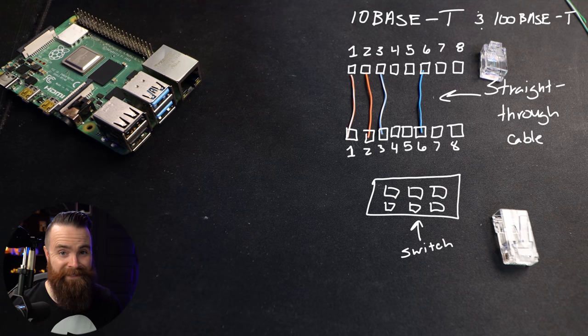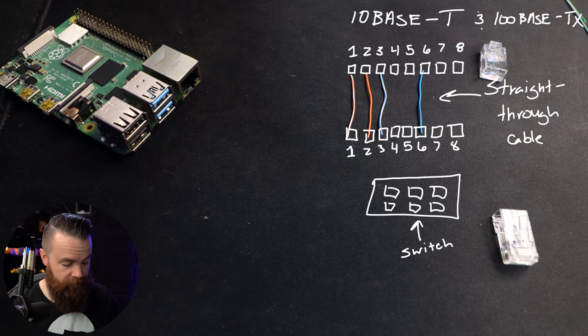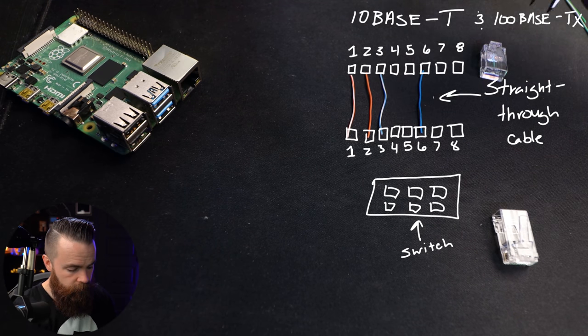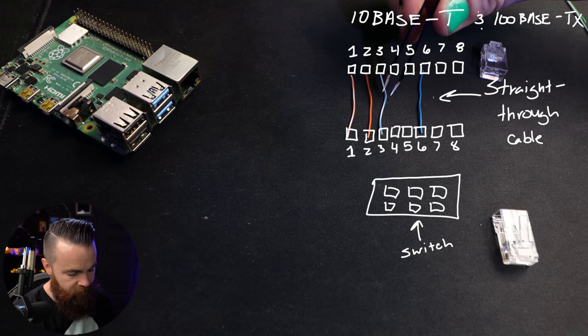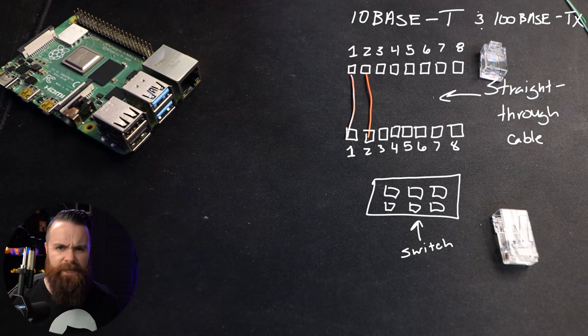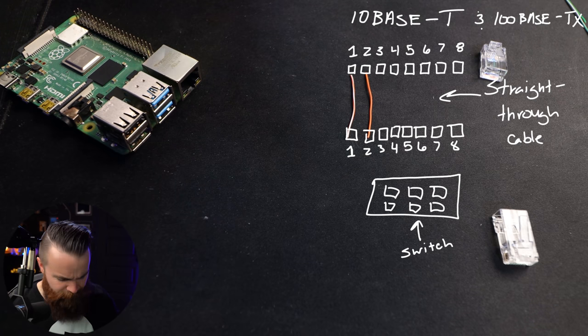The way we've arranged our copper wires inside our pins is called a straight-through design — or a straight-through cable. It is by far the most common cable you'll see, and it's the one we're making in this video. We connect our endpoints — our PCs — to switches, and that calls for having the copper wires in the same positions on each side: 1 to 1, 2 to 2, 3 to 3, 6 to 6. Now, if you want to properly make a 10BASE-T or 100BASE-TX cable, the way we put our colors in order is extremely important. For those standards, we commonly use the orange pair on pins 1 and 2, and the green pair on pins 3 and 6.